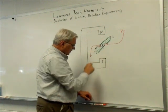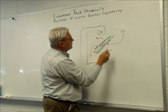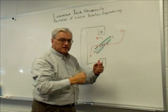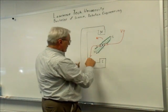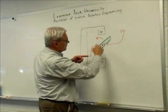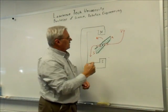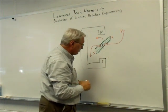This south pole is attracted to the north of the permanent magnet, this north pole is attracted to the south, and we're going to rotate this way. As we get close enough, the brush will rotate past the blank spot on the commutator and touch the opposite segments, reversing the induced magnetic field direction to south and north. But since we've already passed the poles, it will keep rotating to the next position. Normally a brush DC motor doesn't have just one set of coils — it has many — but this is a simplified explanation.